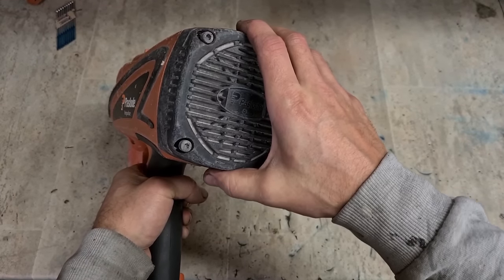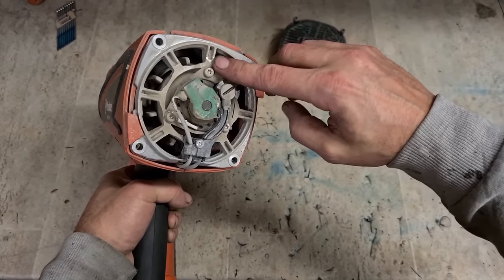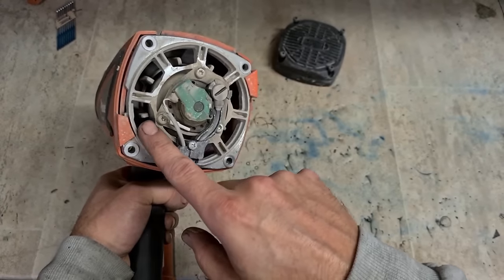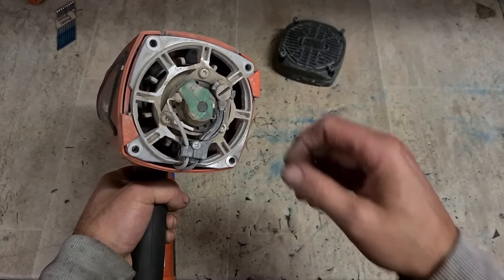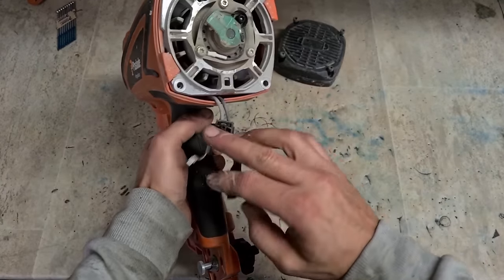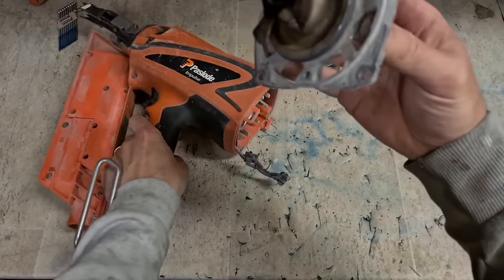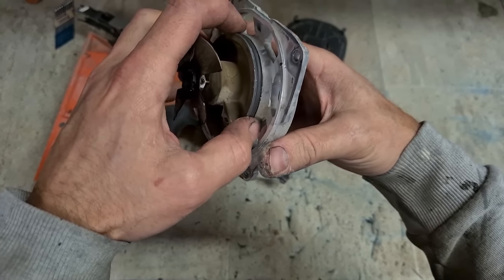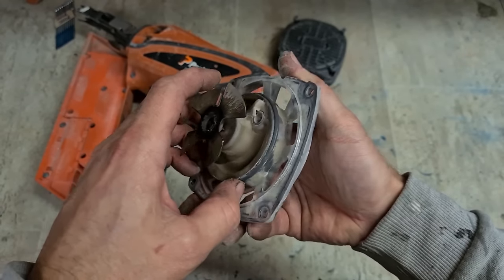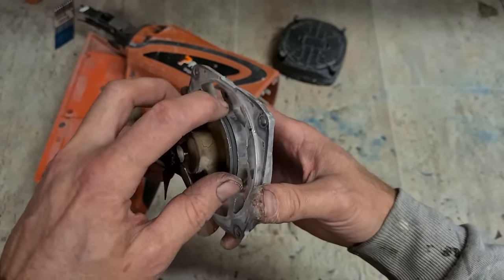That's where you can tell if it needs a service. It's not dirty. It's actually just bone dry. It's full of dust. Cement dust. Why would that be on there? That's probably why it's sticking. No grease or oil whatsoever on the o-ring. Mind you, the o-ring looks okay. Might need to be changed.